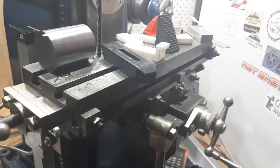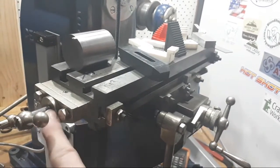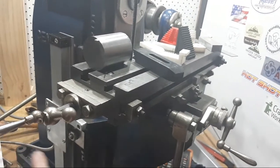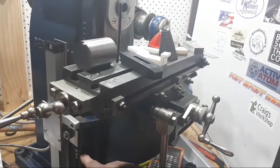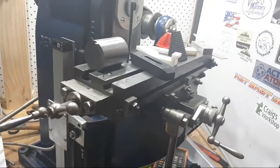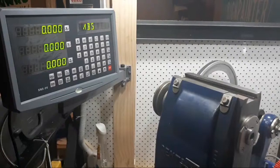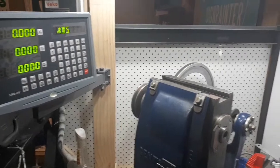But the DRO is what you need, Max, when you haven't got hand wheels with graduation on them. If you have a look at this one here, it's missing. And the vertical, I've got this handle at the back. And if you have a look down here, this little screw with a Tommy bolt hole, that's our fine adjustment. But this is pretty good, and it's got a screen up here that's nearly bigger than the mill, but it's kind of nice, and I'm going to really enjoy that.